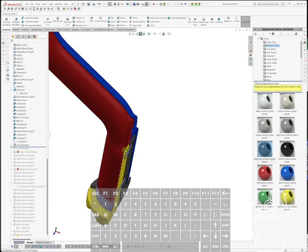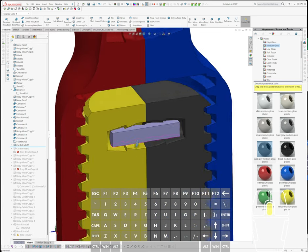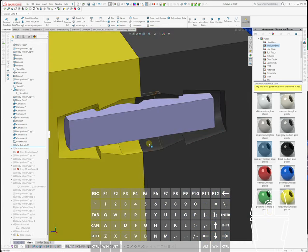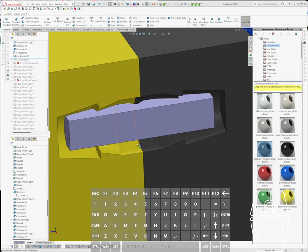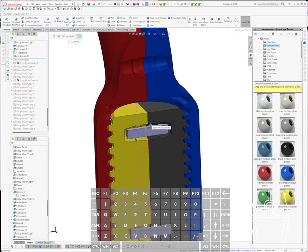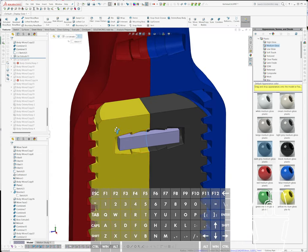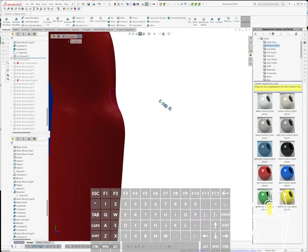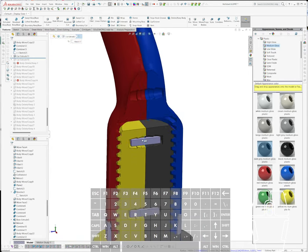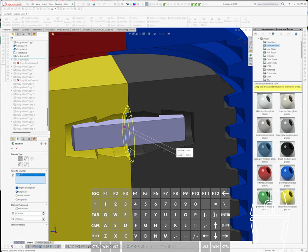So now, this relief here, but these here are fine. All right, so the other thing I want to do is put a chamfer here on both of these pieces so they don't get sort of that elephant's foot fouling the outside of the threads. And I should also do it on the outer parts also. So let's just do that here. That's the wrong key. Well, why not you? And hit that guy.